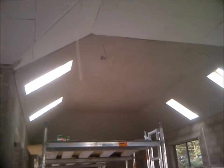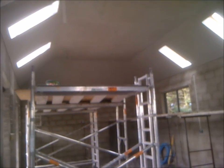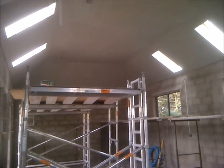And that's just showing you a bit of an angle there to the bellcast flick at the bottom. We're on to this last section of the ceiling, the bonding and skimming. So let's just look around. There's a little first coating to be done left on the inside and the outside actually. Most of the scratch coating's been done. And maybe for the next episode I'll show a wee bit more of that sand cement work being done.